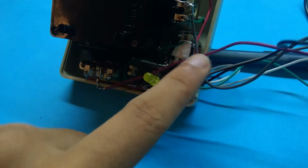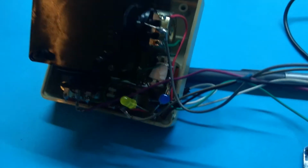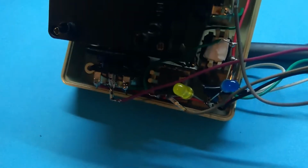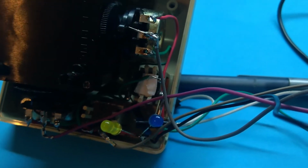The LEDs, as indicated here, I used 2 different colors because it looked nicer and I didn't want to finish my blue LED supply. However, the LEDs do cause a voltage drop, which I had to fix in the software and the Python code. I've also got the resistor down at the bottom here. So that's just to prevent it from shorting.